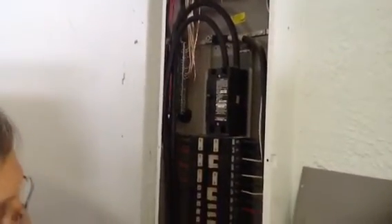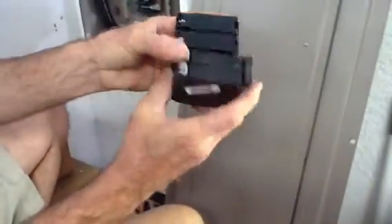You do not have to isolate your neutrals and your grounds because you don't have a four-wire system. I also want to point out the different feet on the breakers. The Cutler Hammer tan — see how it's got the claws.